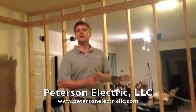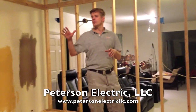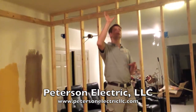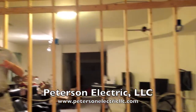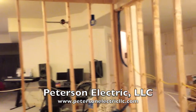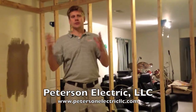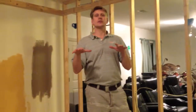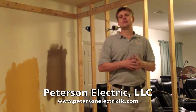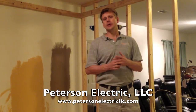The other thing we're looking at doing here is keeping our power separate. We've got power designated for our projector with our screen. We also have it for our AV equipment and our two bass speakers up front — it's a 9.2 surround sound system. We want to make sure that all of those electronics are on the same phases and that our wattage and amperage is not too high on the breaker.